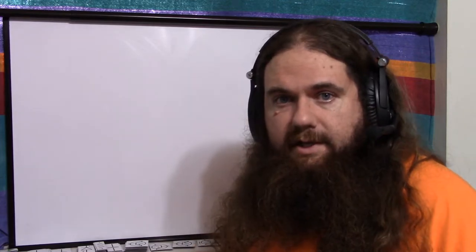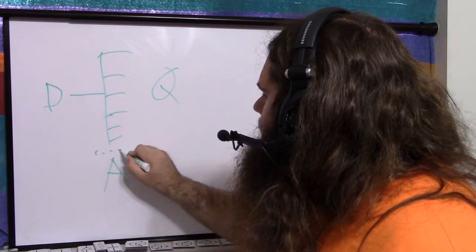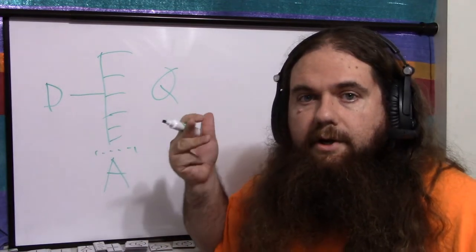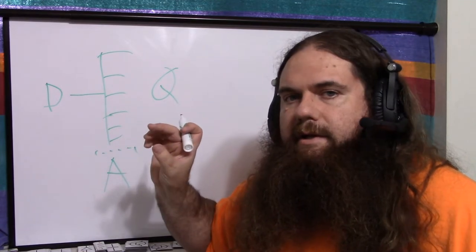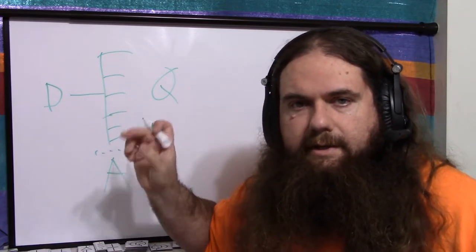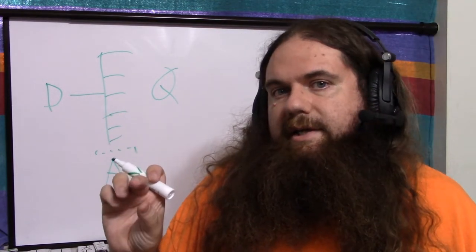And then you've got decode. So once again, you've got your data pin, and then your outputs and your address pins. So a decoder, a binary decoder, is something that takes a binary number. So 3 bits would be 0 to 7, so 8 possibilities. And then it outputs a high, or a low if it's active low, but in this case a high, to the one that's being selected. So a demux is meant to take a serial signal and split it into parallel. A decoder is meant to send an enable signal.